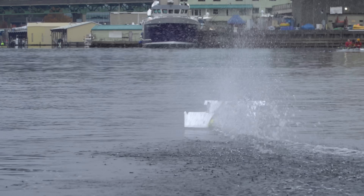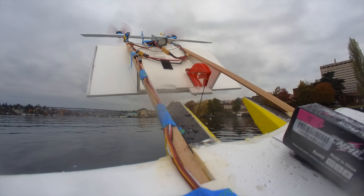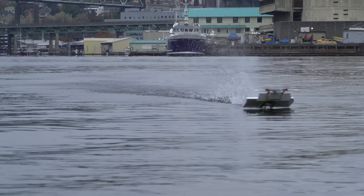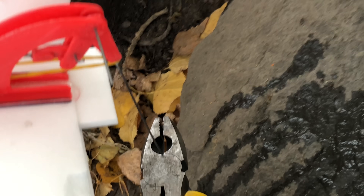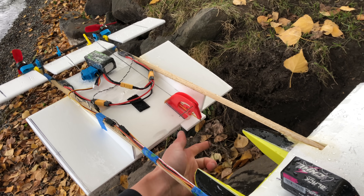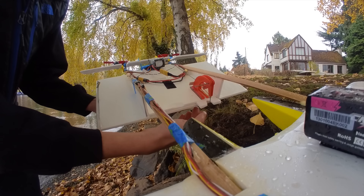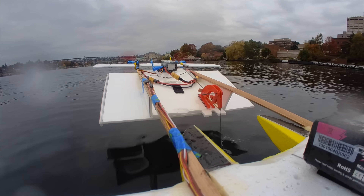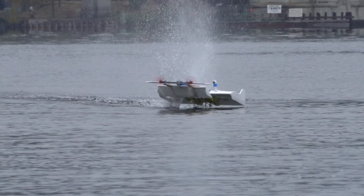The first test didn't work so well — it was getting too much lift from the front and flipping up. From the onboard footage, the wand was reacting a little too late to push the nose down. I adjusted the wand control linkage to give it more throw, but the nose was still riding a little too high. To make the canard react more at lower altitudes, I cut the wand down shorter, adjusted the control rod length to give the canard more of a negative pitch angle, and cut a notch in the wand's hard stop so it can rotate further down and go past vertical.